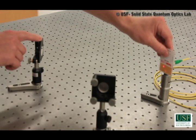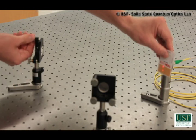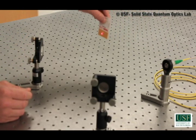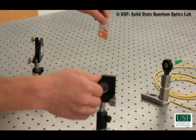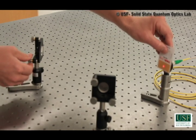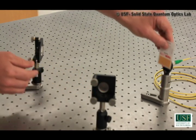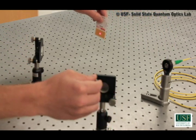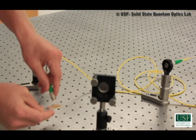I'm going to adjust this mirror, and this will move the infrared beam until it overlaps with the red beam. Now I need to go to the other point and move the mirror further away — this will move the red beam, so I'm going to move the red beam to overlap with the infrared beam. I need to go back to this point because adjusting this mirror slightly changes it. So now I need to move the infrared beam back onto the red beam, and just keep iterating this process until you get them as close as possible. That looks pretty good. Now we can check the back end of the fiber and see if we've coupled any of the light into it. As we can see, there's just barely coupling in.